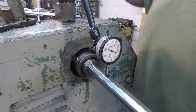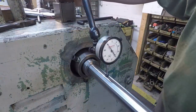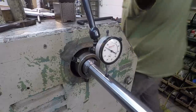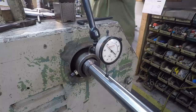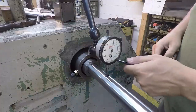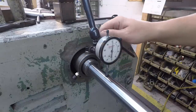First thing we've got to do is go ahead and snug our bolt up here on this side. Go ahead and zero out our indicator. And I need to tighten the chuck. I didn't do that. Make sure the chuck is tight first. I just had it lightly snugged up, so, all right. So there's our highs, and we may need to, that's still the high. May have to crack those lock nuts loose to get this where we want it.